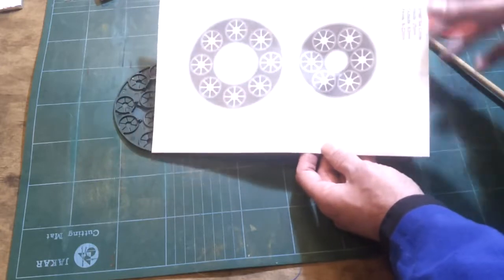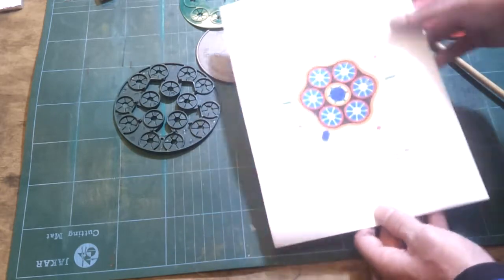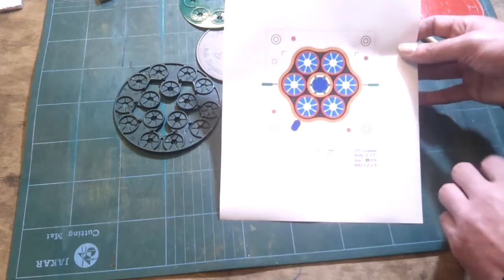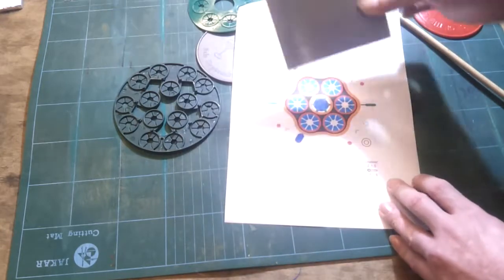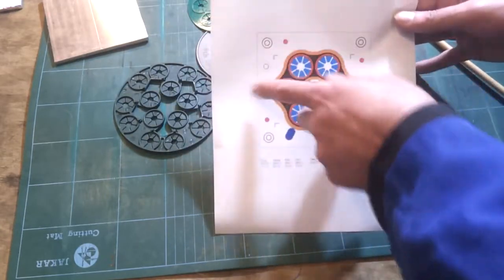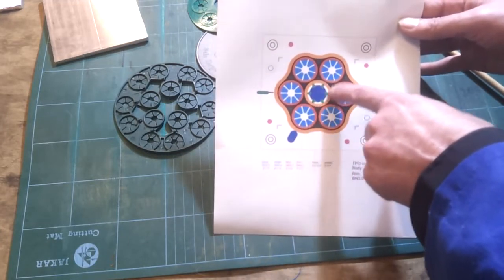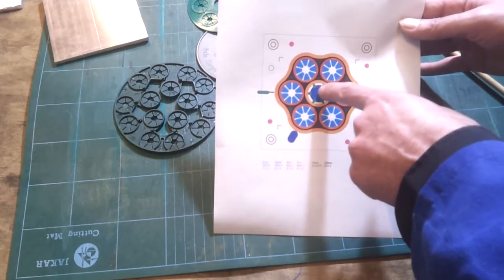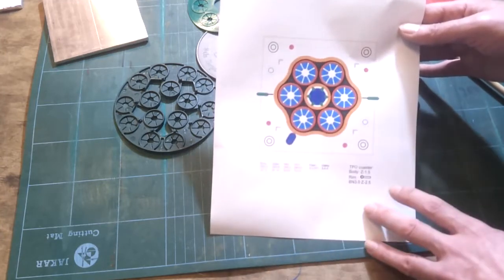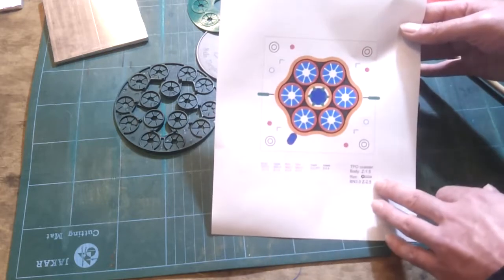So I'm thinking I'm going to go for that sort of size, and with a little bit of pimping up, this is the design that I've come up with. So basically it's just a simple square plate of aluminium, which I've actually got already. I've already trimmed this out and marked it up, and then I just need the usual bolt holes, some magnets, some locating points, vents. I'm going to feed it off the middle and use a kind of star-shaped gate here with some small gates going onto the main cavity. That should allow it to flow quite well. Might need a bit of extra venting around it, but we'll see how we get on.